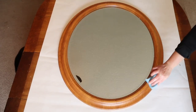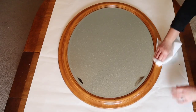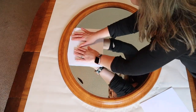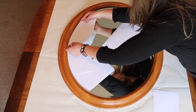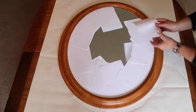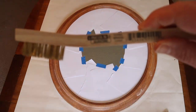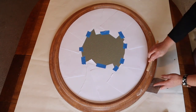Now we have to clean our mirror and we are going to sand it. I used dish soap, but really you can use anything you want — Simple Green, Crud Cutter, any of those will work. Whatever you use to clean, you're going to want to wipe it off with just some good old fashioned water. I'm just wiping off the mirror and getting all that residue off. Now I want to protect the mirror. On this particular mirror there is craft paper on the back, so I got some copy paper and I'm just tucking it in between the frame and the mirror. Now you see me with a couple of tools: I have a brass wire brush and then a sanding screen.